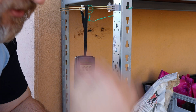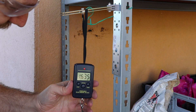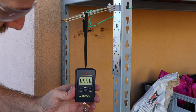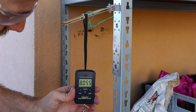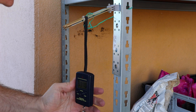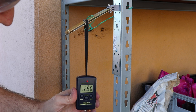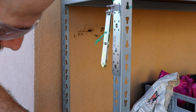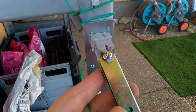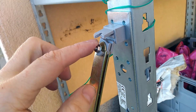This is now PETG printed in horizontal position - theoretically this should be the strongest, but we will see. The full weight of 10 kilograms is on it, I'm pulling it down now... 12, 13... And this is how it broke - the last piece. It broke but it's still attached - that's why I like it. Even if it breaks it doesn't fall off completely. Look where it broke: here and here.